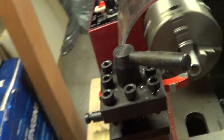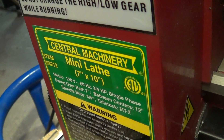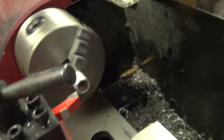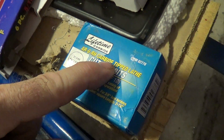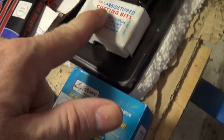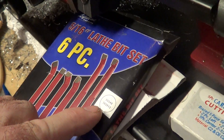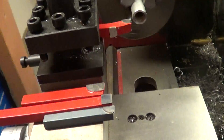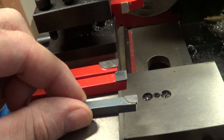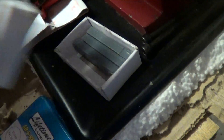Anyway, that's the mini lathe, the 932/12, just showing the bits. Here are three different types: 3/8 is a little bit high, quarter inch is low and could be shimmed up, and the 5/16 ones — 35540 — are actually the correct ones that will fit it. I've also used these little insert bits with a plate up on it and they work pretty well too.